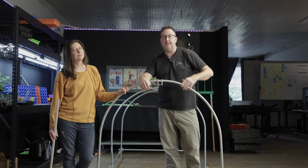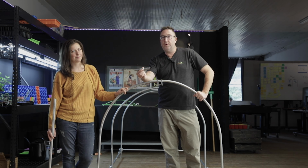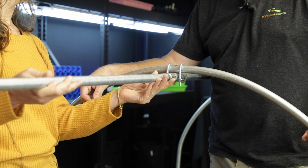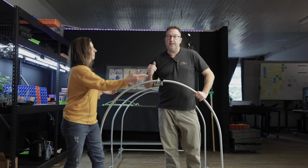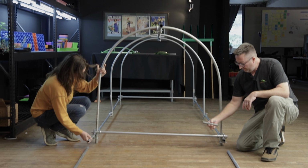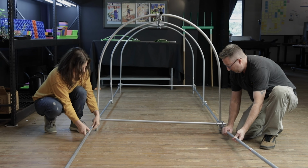All right, so again, 10 foot worth of bed covering behind us. If we wanted to extend this out in 10-foot sections, it's almost infinitely possible. With the 3/4 inch EMT couplers, simply place one in. I personally would run a couple of number 8 screws in there just to hold it in place. Same thing down below at our baseboards, couplers in the hole, 10-foot long sticks.